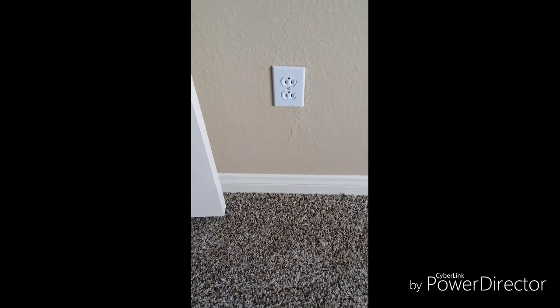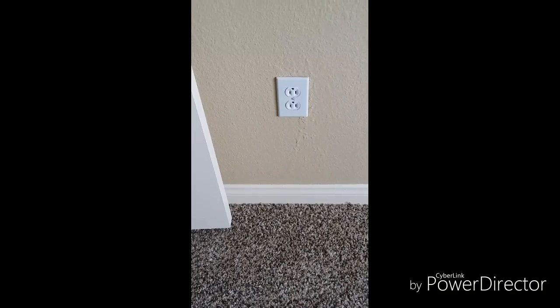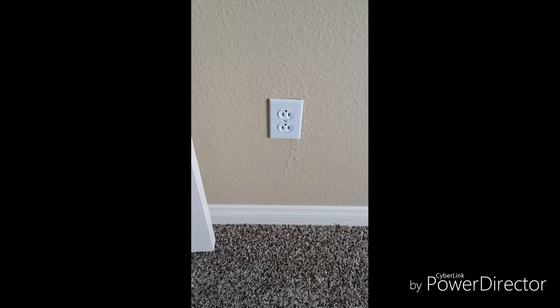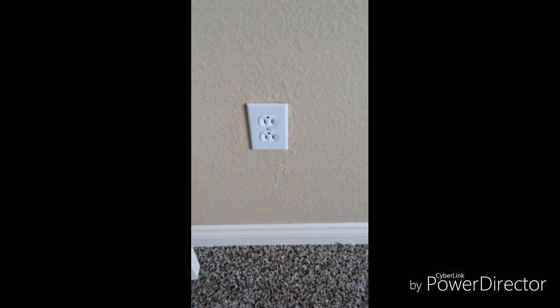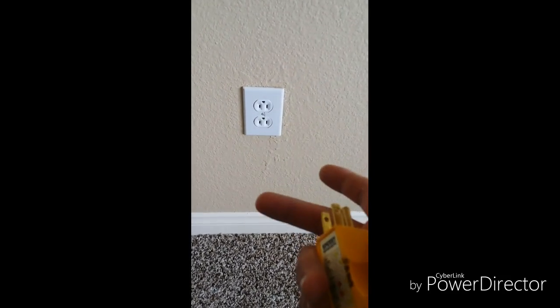Here's basically a simple way of identifying which outlet works off of your switch. If you walk into your bedroom or your living room, usually the contractor will put the outlet upside down. This will signify to you that that is the key outlet that will work with the switch on the wall. I have run into a few instances where somebody came back, rewired everything, and swapped it back to the original position.